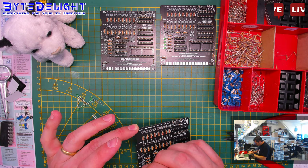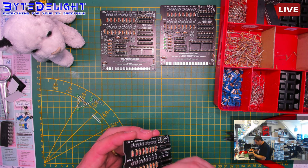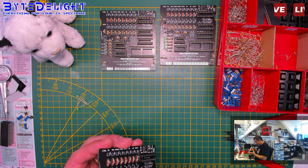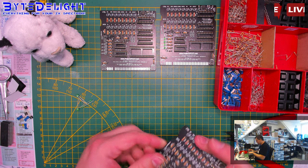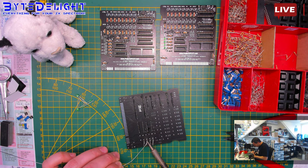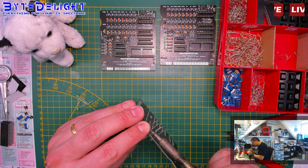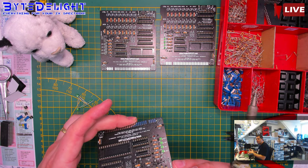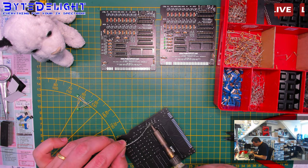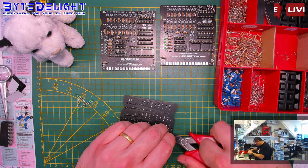Left, sorry. To the left. And only D3 should go to the right. All right. Left again. And one more. All right. Alrighty, mate. So I only solder one side to start with, and I push them down so they are straight up. That always takes care of making sure that they're aligned properly. Sometimes with some LEDs, you've got some plastic edges that will mess up what I'm doing here, but most of the time it's good.